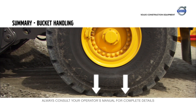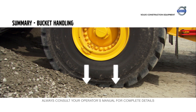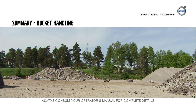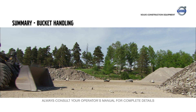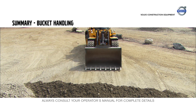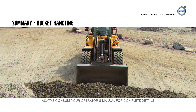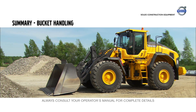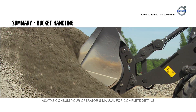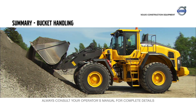Make sure you have high pressure on the front wheels. Adapt engine RPM to prevent wheels from slipping. See that the ground surface is always as level and clean as possible. Always enter the material with the machine running straight ahead. Lower the bucket parallel to the ground, throttle up as much as needed, lift the bucket, then tilt back and reverse out.